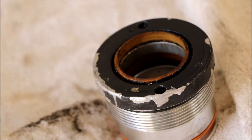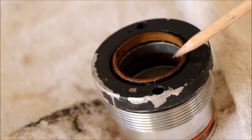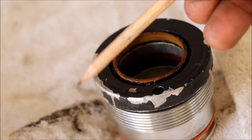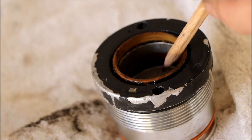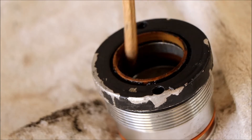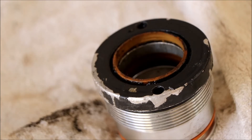These are the two seals on the inside of the cap. This one just cleans all the crap off the rod as it's sliding in and out, keeping dirt from the inside of the cylinder. There's another seal on the inside which actually holds the fluid back - that's what generates the pressure to move the rod back and forth.